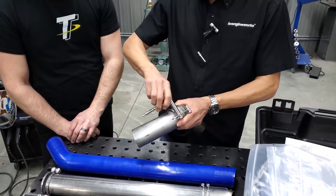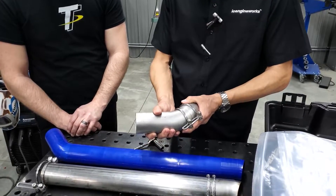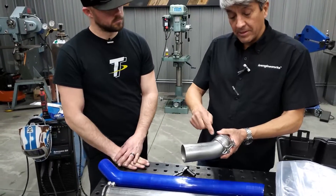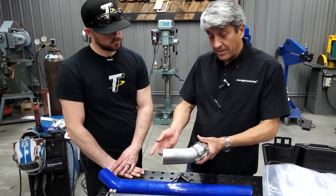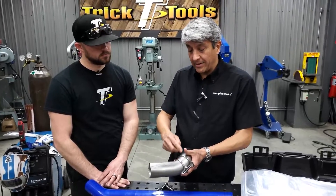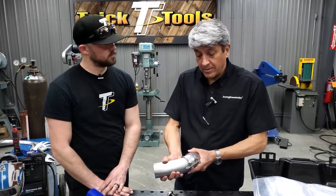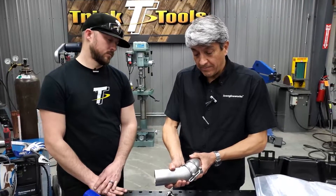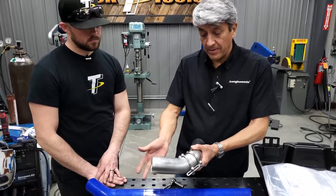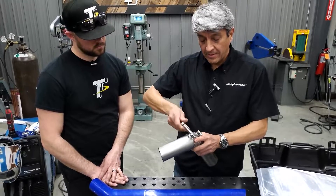Rotation is really simple — you can just loosen them up a little bit to make all these minor changes. In the past without the clamps, you might remember having to witness-line it, and if it didn't work you wouldn't find out until the end, then you'd have to break it, clean up, and do it again. This way you can make very little changes and test until the ends are matching, then just commit to it and go for the weld.